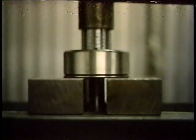The workman has completed disassembling, cleaning, and inspecting the pump. If any of the measurements had been out of specification, the necessary repairs would have been made. In this case, all measurements met the manufacturer's specifications, so the workman is ready to begin pump reassembly. The first step is to press the bearings back onto the shaft.